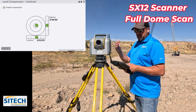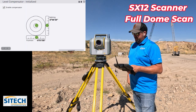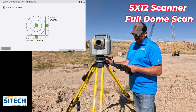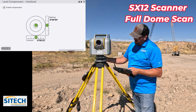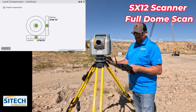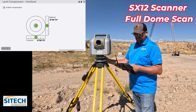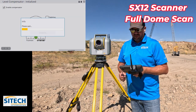So if you watched any of my other videos, remember that sighting is the way that it's sitting this way, trunnion is side to side. So knowing that it's off side to side, I'm going to hit the one right here and click that till I get that as close to zero as I can. Then we'll either hit one in the front or the back to start leveling it up frontwards and backwards. It's a little bit of a game back and forth because some of those set screws are not always set the way that it needs to go. So it's a little bit of both of them. Once we're level, enable the compensator, go ahead and hit accept.